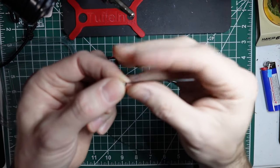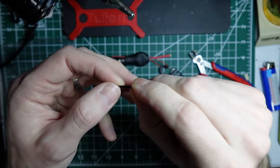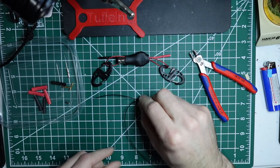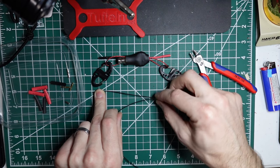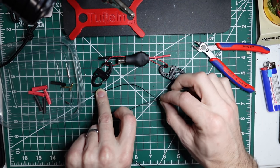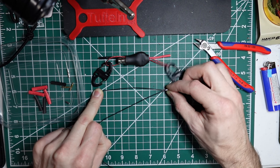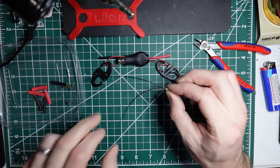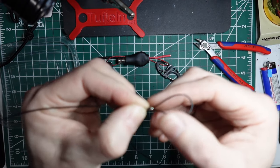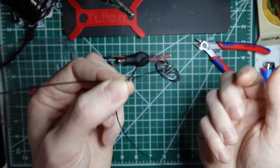All right, so you're going to get to see this twice. What you're going to do is feed the wire through the ferrule. This is going to be the connecting end. So you're going to then have a loop and feed it back through. And so what you'll end up with is just a nice small loop of wire. And so what I do is I'll hold my wire on one end. I'll move the ferrule to where that's 5 inches long, which is 1, 2, 3, 4, 5. And then I'll pull the loop back so it only completes the total length of 6.5 inches. So you'll have 5 inches from here to here. And then from the base of the ferrule to the end of the loop, you'll have another 1.5 inches. Hope that makes sense. We'll do it again here on the other one. But then what you're going to do is you're just going to kind of hold it in place.